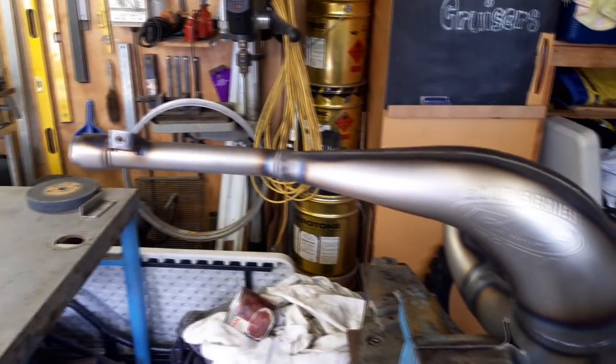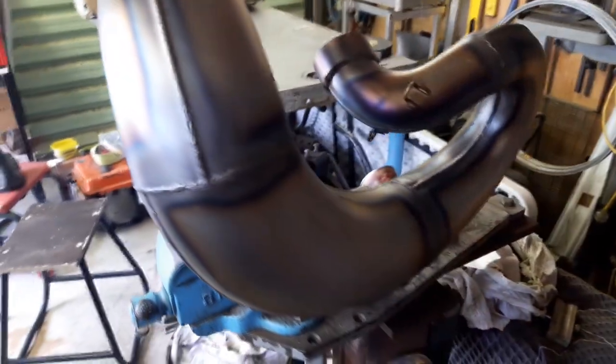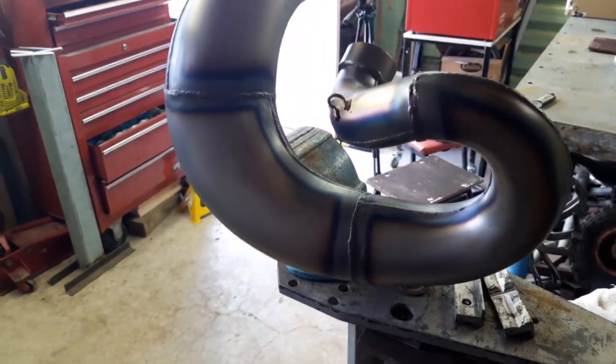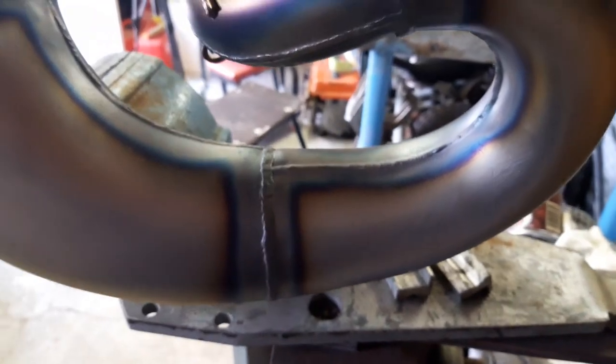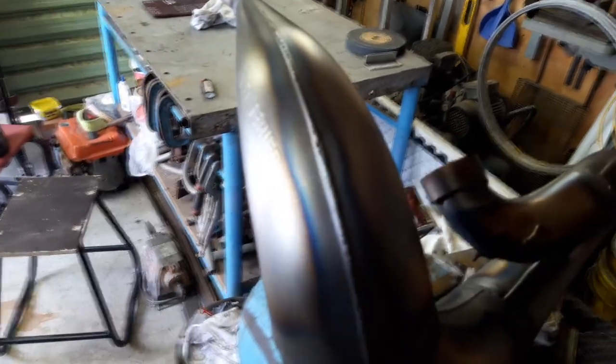I've just got done fully heat treating the welds on the expansion chamber and it's come up really sweet. I've done every weld all over the pipe, all the seams and stuff. I got them pretty thin really for the torch I was using. That was the very first one I did on the pipe and then I just ran it down — obviously hadn't done it in a while so it got really patchy and inconsistent. The good thing about this finish is you can just scotch brite it off and then just redo it, so that's what I did on this one here and it came up a lot better, managed to get it quite a bit thinner.